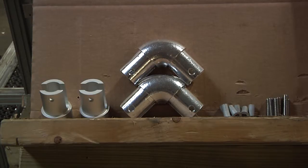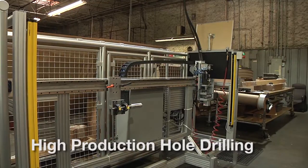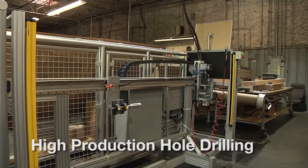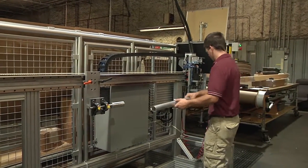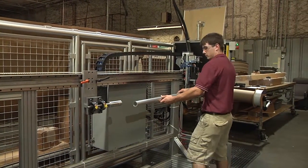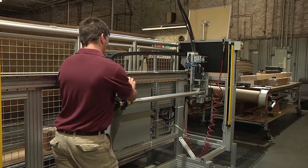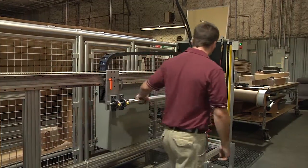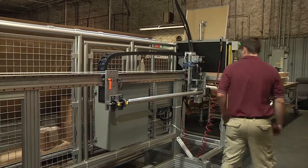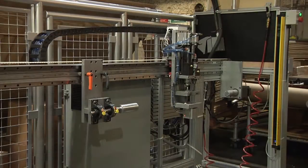In the first step, we assume your pipe will come in cut to length. The second major process involves drilling holes in the pipe. We started off several years ago with what we call a gang drill, which was a 24-foot long device set up to handle long pieces of pipe. All locating and drilling was manual. As our railing business grew, we developed both a CNC railing hole drill for lengths of pipe up to 24 feet long, and what we call a CNC post hole drill for pipe up to 48 inches long. We are showing this post hole drill in this particular shot.